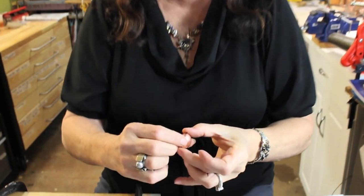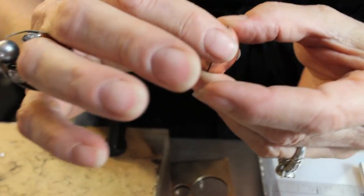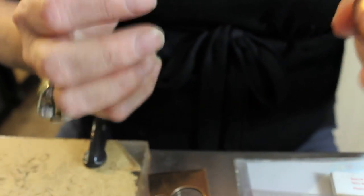If you're going to make tons of these, go ahead and punch out, cut, or buy all your discs at once. Work step by step — work the same depression with all the beads first and then move to the second, otherwise you're going to get really confused and all your beads are going to be different sizes. The goal is to have the edges meet without overhang.